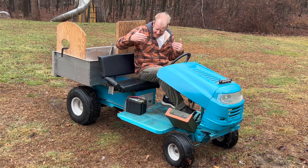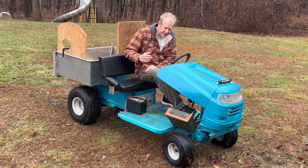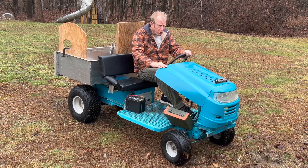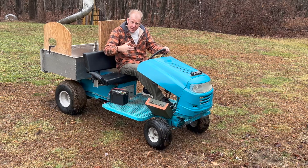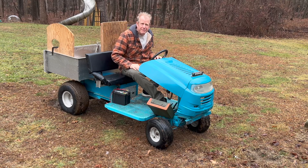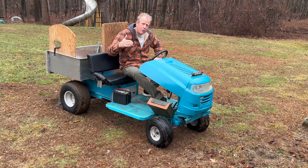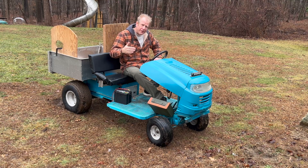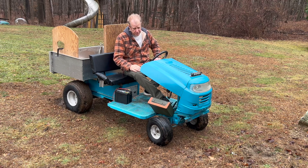The conclusion is it will not take the extra voltage with another battery tied in series. If I put it in reverse it will go, but in forward it cuts out like that. The best I can figure is that the motor controller has a high voltage cutout, because it acts just like it does when the voltage is low on the batteries — it gives you that jerky behavior. Actually it's a little bit worse.